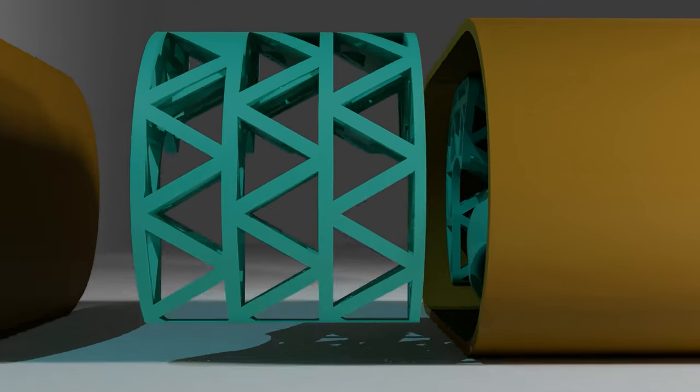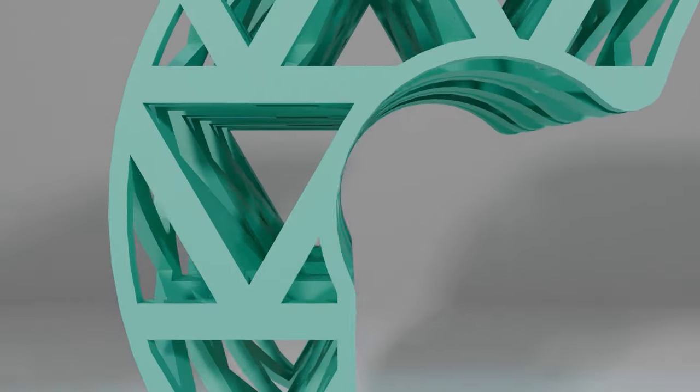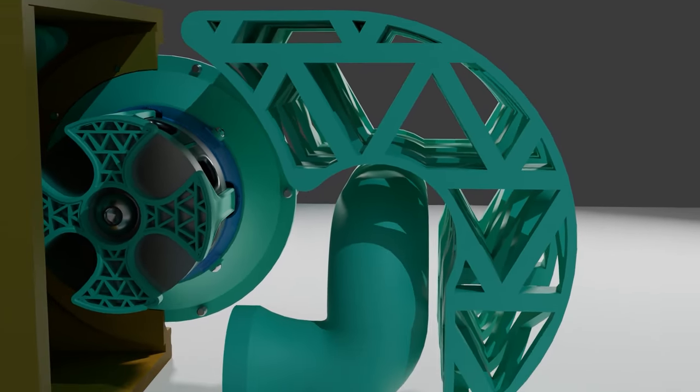The diffusers used in this build were designed around the fact that I'm using additive manufacturing and can create very complex shapes to hopefully reduce standing waves in the internal volume of the box. They have a lattice structure created from a cross section of triangular cutouts. These 90 degree intersecting triangles create a pattern that can hopefully disrupt any standing waves and improve the sound coming from the internal volume. The inside of the box is more complex than any previous versions of my speakers.